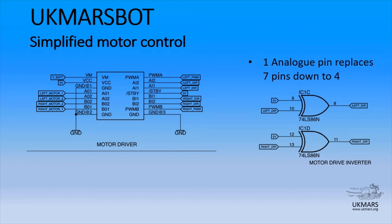We've used the XOR gates for other things too since we needed to install them anyway. We put quad XOR on there; we're only using two for motor control. We're actually using the other two to improve the resolution of the quadrature encoders on the back of the motors. There's very good material about this on our website — good reading, though probably beyond the scope of this initial presentation.